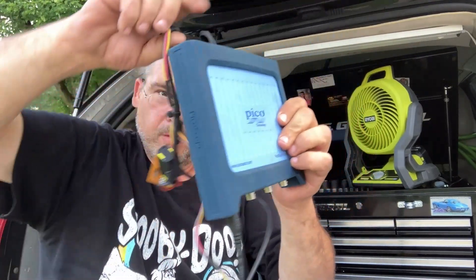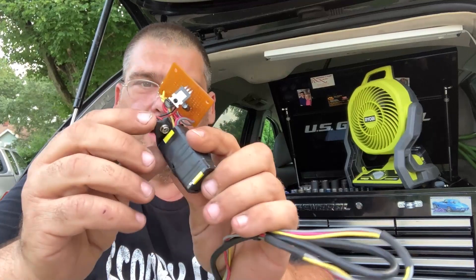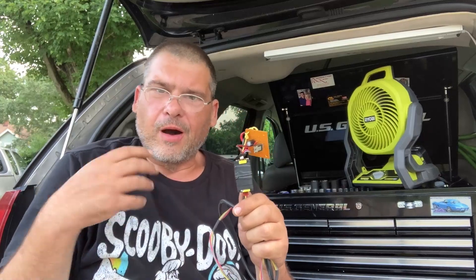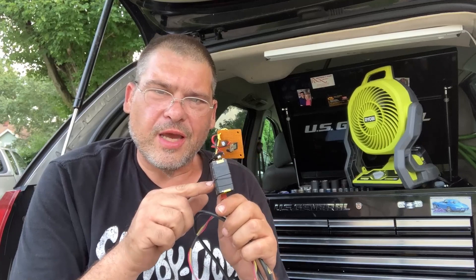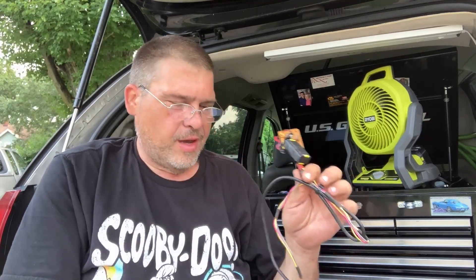The nine-volt battery I normally leave unhooked and just hook it up when I'm going to use it — that's how I turn it on and off. The reason I put a separate battery on here rather than powering it off the car's twelve volts is that under low-battery conditions or while cranking, that voltage is fluctuating. I just want a really steady voltage to give accurate readings to the scope. The LM7805 brings it down to five volts, and it returns a reference signal.